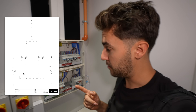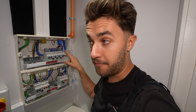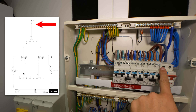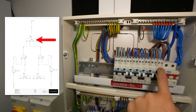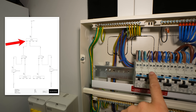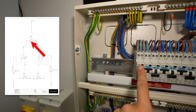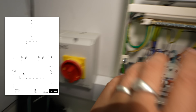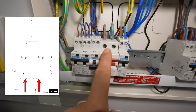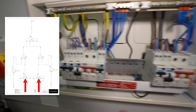Now that we're armed with this drawing I can explain how all of this actually works here at the consumer unit. If you're wondering why I've gone for Proteus breakers — as far as I'm aware it's the only bi-directional RCBO that's made, meaning it will protect you in both directions with solar. We have our supply coming in, that's our row of grid breakers. Then a breaker going out to battery one via an isolator outside, then a breaker going out to battery two via an isolator outside. That comes back through these isolators — isolator for battery one, isolator for battery two — then back into their respective off-grid DB1 and off-grid DB2. If you've got any questions or anything you'd like me to make a specific video on, please ping me below. Thank you so much for watching, see you next time.